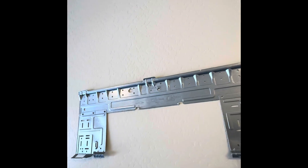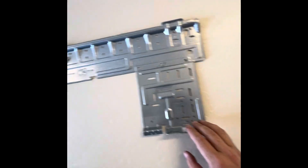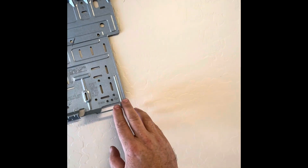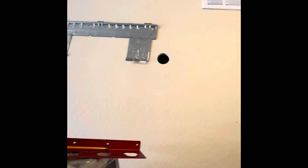It's 8:45 right now. Joys of knowing how to do air conditioning. So the head's going to go right here. The line set's going to go right here. So I just got to level this out, mark my holes for my other screws, and then I'll mark my hole for my line set. And that's where our line set's going to come through.